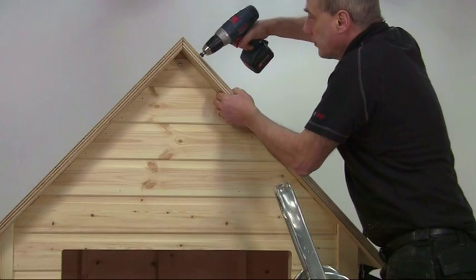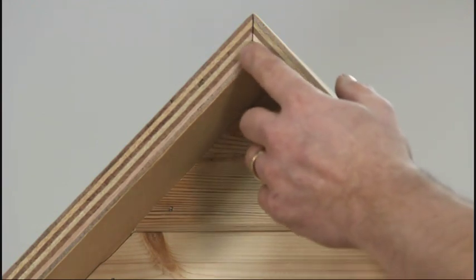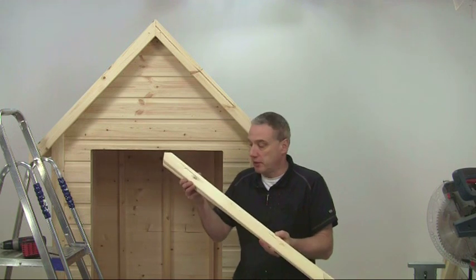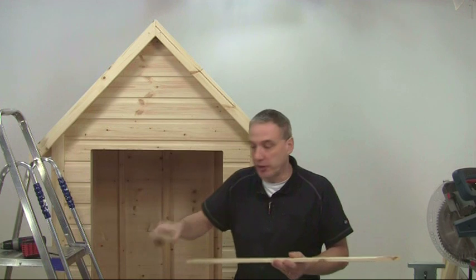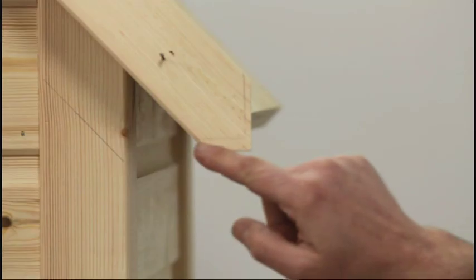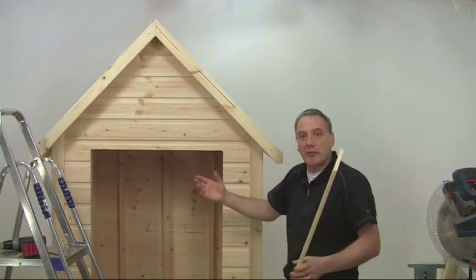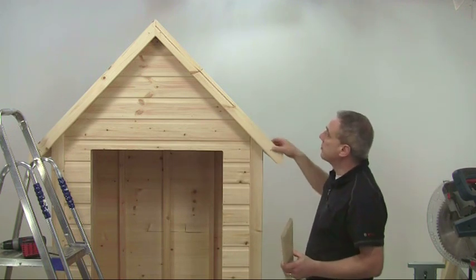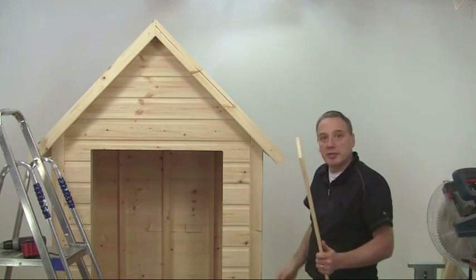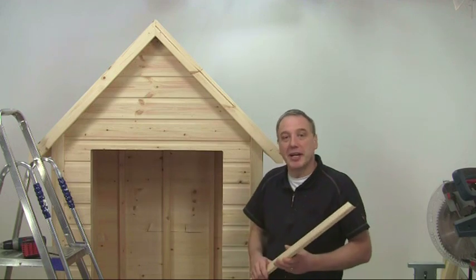If you set your saw at 45 degrees when you cut these two roof boards you should end up with a nice mitered top. I'll cover the edges with a little trim - these trim strips I've actually cut down from off-cuts of the tongue and groove door material. You need a 45-degree angle on one end to go up to the apex, and at the bottom end I've put two 45-degree cuts. I've just pinned these on for now so you can see what it looks like - all this will have to come off again when we dismantle it to move on site. It leaves a much neater finish to the edge of the board and will also hide the edge of the felt. That's it for part three - come back for part four where I'll fit the doors, add a few finishing touches, and finally get it on site.